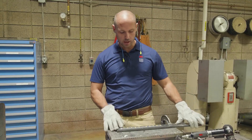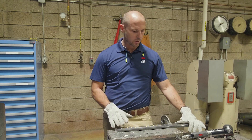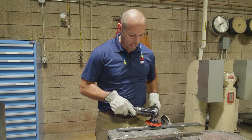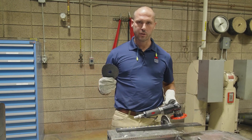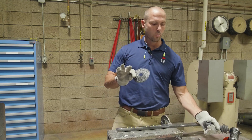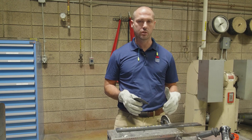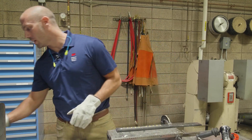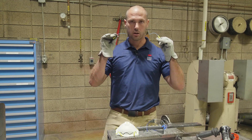Now that we have our substrate with about 12 inches of weld laid out, we're going to take our 982C Cubitron 2 fiber disc, grind half of it, and time ourselves. Then we'll take a traditional fiber disc with crushed abrasive and time ourselves on the second half. About 12 to 24 inches should give you a good understanding of how much faster this product performs. Before we start grinding, we need PPE: glasses, a respirator, gloves, and earplugs.